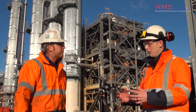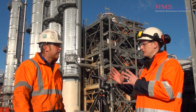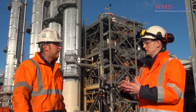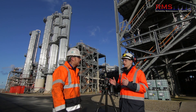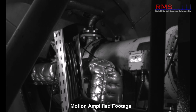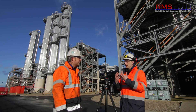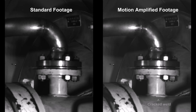On frequency range, we felt one area we could push was high frequency vibration. The camera measures in displacement, so it's really favorable at low frequency, but we wanted to see how high we could go. We got some really good shots on a power turbine where they had high casing levels. We put the camera on it, did a quick scan, and at 7,500 RPM we found a crack in the weld.